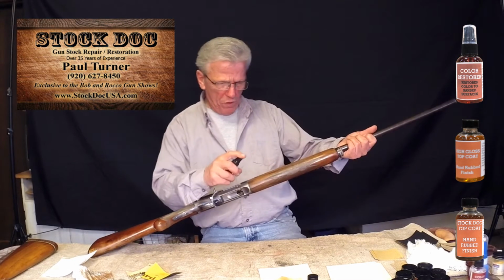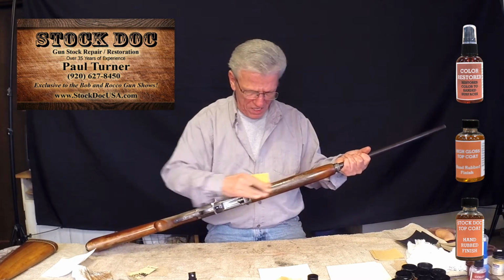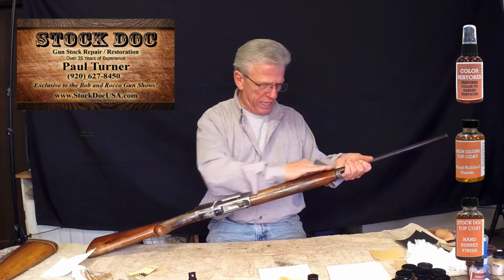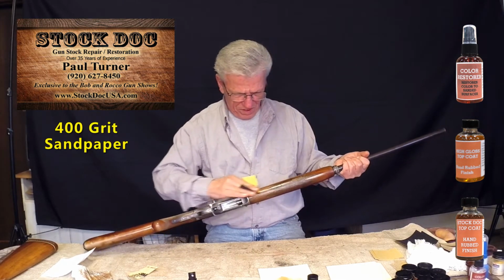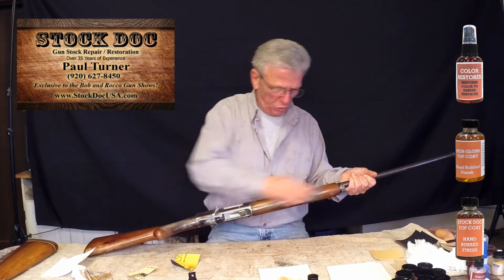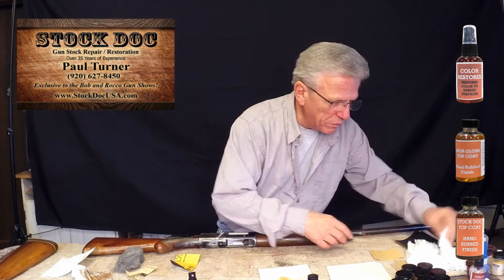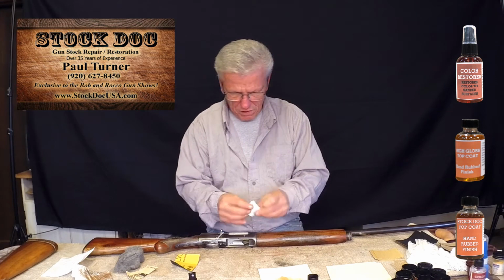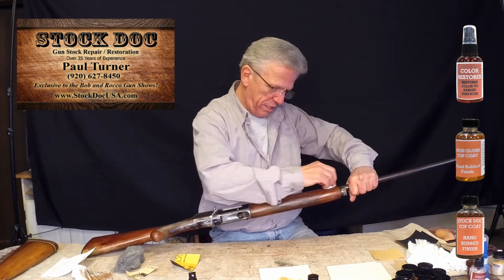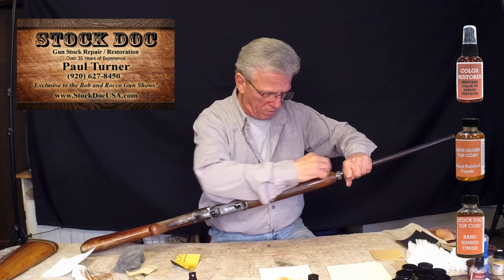Okay, now we're going to move up to the forearm, I'm sorry. Stay away from the checkering. Just lightly sand it with a 400 grit. That brings the color back. Wipe it off. Again, you're going to want to take a piece of terry cloth, dab it, and then just rub it on, staying away from the checkering. You don't want to fill in the checkering.